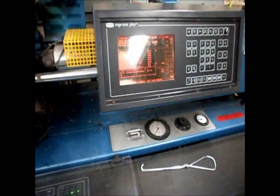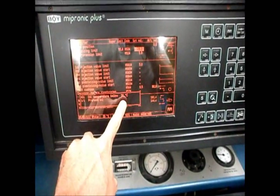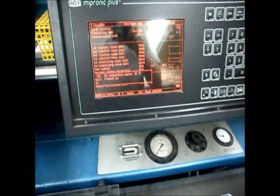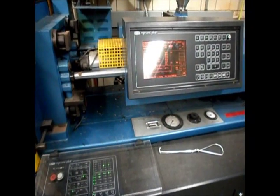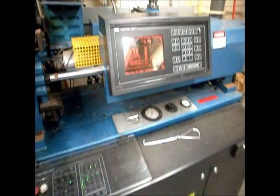Next, turn on the cooling water. We have the main cooling water valve right here — just run that as you would turn on any other valve, and there's a little water flowing. Then open the drain valve — there's a clear tube here, and that'll drain a little water out into a floor drain. Once it's turned on, it'll say oil temperature below 30°C. It's preheating right now. You'll see a temperature deviation of negative 200 at your actual end stage, and you're going to want to wait until this gets up to 42 degrees C, which takes about 20 or 30 minutes.